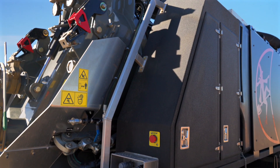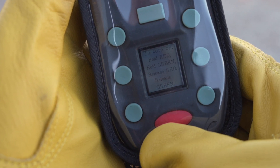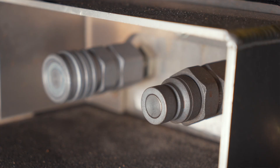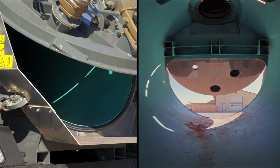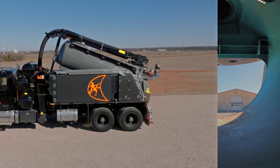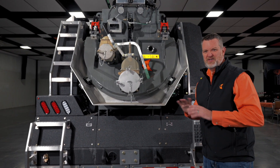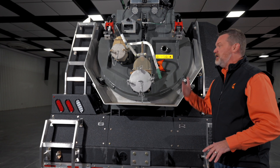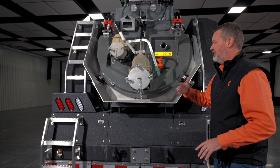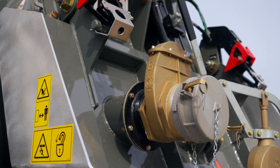On the back of the truck we have the e-stop — two e-stops on this truck, one at the back and one on the remote. We also have auxiliary hydraulics here, 12 GPM circuit, same as our previous truck. Coming to the back, the tank lifts and then the door fully opens, making it a lot easier to dump your spoils. There's also a vibrator on board — if anything is sticky or settles out when traveling a longer distance and starts to dewater, you can turn on the vibrator to help shake that out. We have a dump valve here, and also an in-port if you want to suck into the back of the truck, particularly for a micro trenching application.